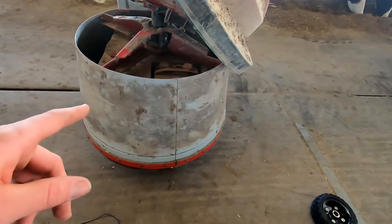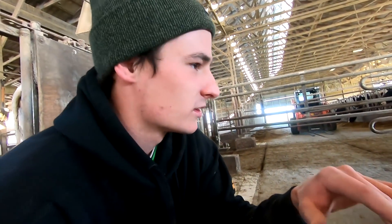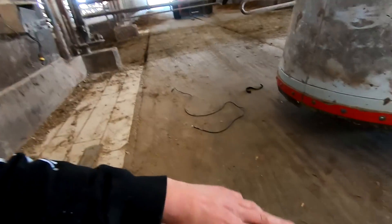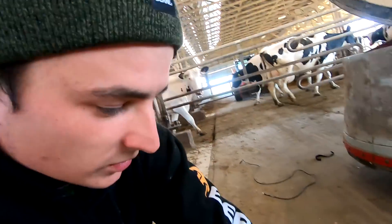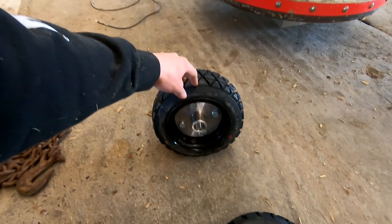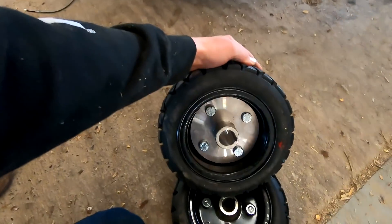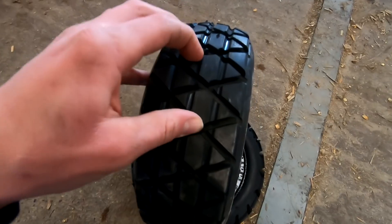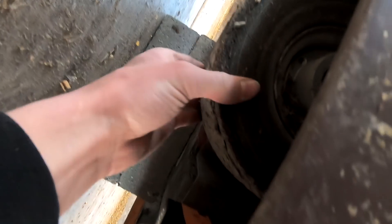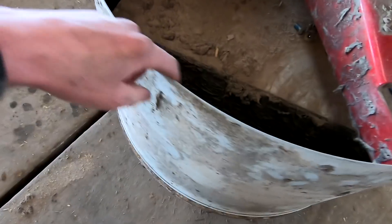The other thing we're going to do with the robot while we're working on it is put on a new set of wheels. We have a lot of issues with it sliding around when we get humid weather or a lot of rain — the floors get slick and it loses traction and can't really work; it runs off track and gets lost. So I wanted to try something different. I got these wheels — these are not from the Leli company; these are made by a company called Claw Daddy. They make airless tires for skid loaders and forklifts. I'm hoping we can see some major improvements. You can see how aggressive the treads are. We'll pull the old wheels off — they're pretty worn down and starting to almost tear off. We're having a little trouble getting these tires off, so we're going to remove part of the side skirting to get to them better.